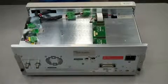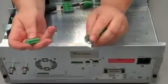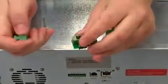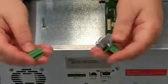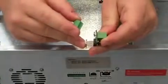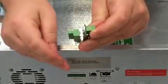The other thing you need to do is get the connector and the adapter that came with your N6781A module. To line it up correctly, there's a little ridged edge on the bottom of the adapter. You want that on the bottom and the screws are on the top of the connector. Take that and line the bottom hole on the connector side with the bottom prong on the adapter side, and just insert the adapter into the connector.